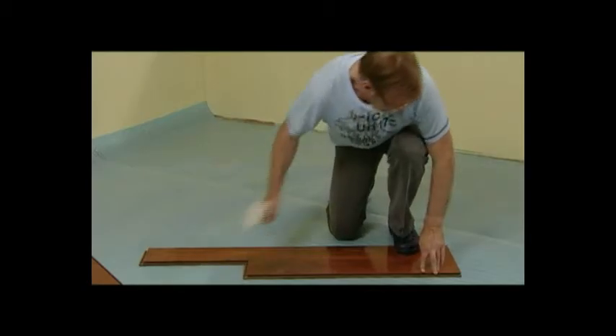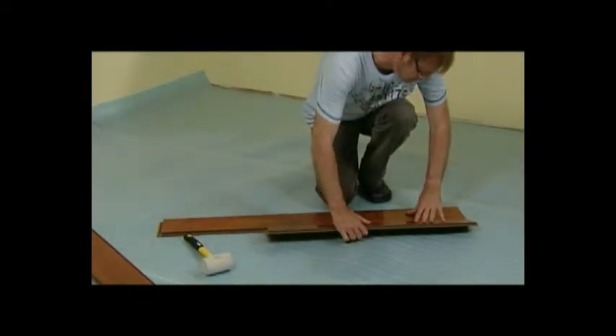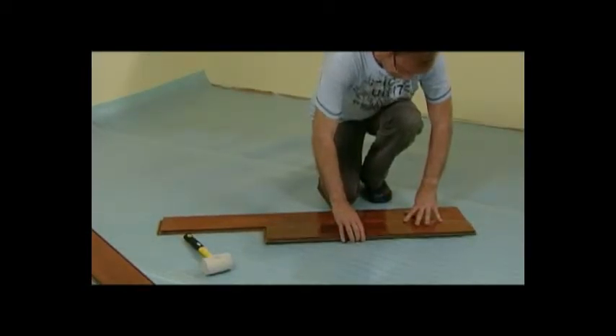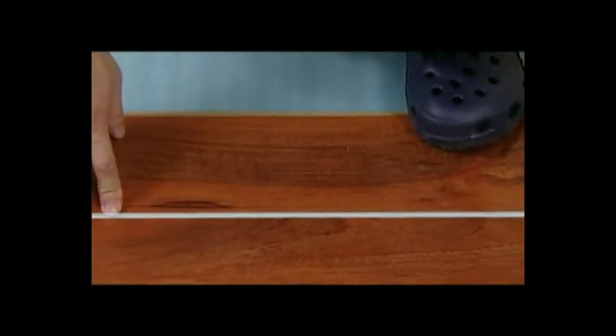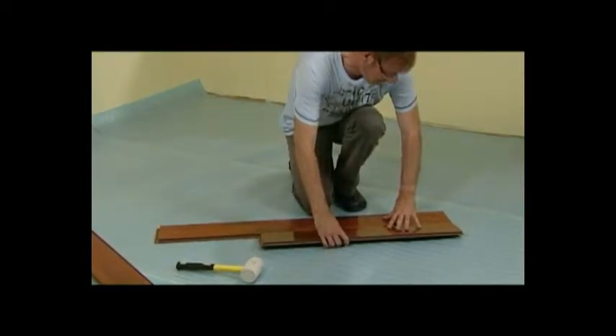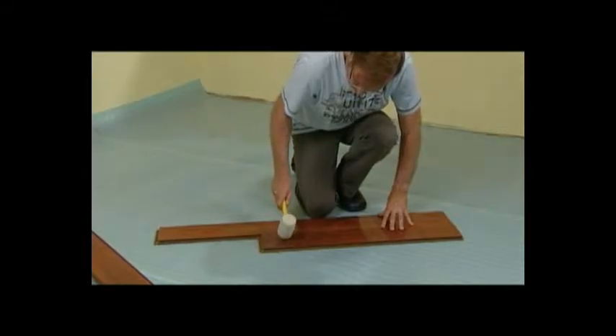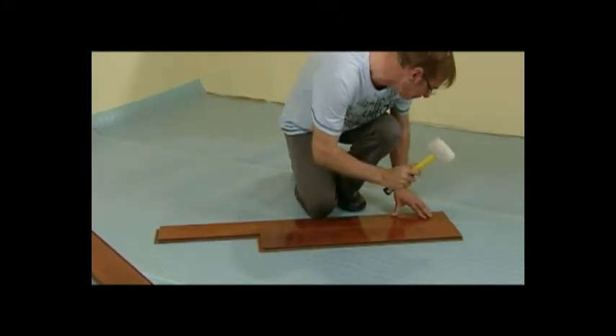After positioning, you should see there is a gap along the joint area. Use the rubber mallet to tap the up hook joint area. The panels will then lock into place together. If panel 2 does not stay flat or if the joint is not perfectly tight, this is a sign that the joint has not been fully made. If this is the case, please either lift up panel 2 and redo as above, or give some more tapping along the up hook joint area until they lock together.